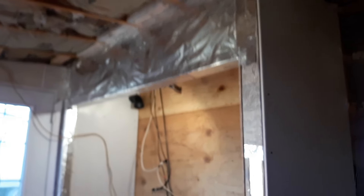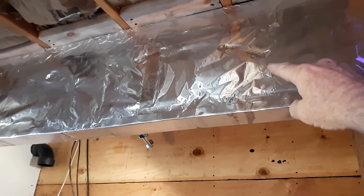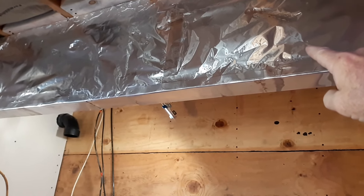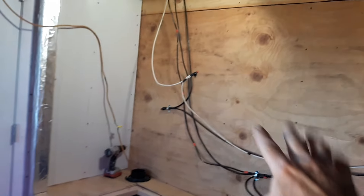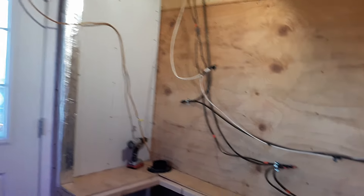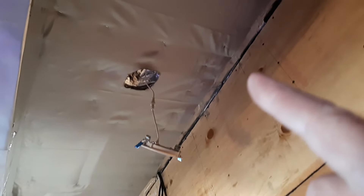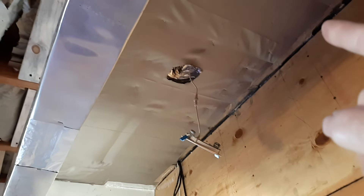This has been a lot of intense building and planning. I want to show you the top of this. We are putting at least four layers of aluminum foil and the cloth up here to block the EMP and the EMF signals. This is metal — we have some flashing here, and we're going to put a frame and a screen wire on the front so you'll be able to look through here but it will still keep in the signals. Here's our light — it's an LED light going up in the ceiling in that hole. We've got our silver nickel cloth and our aluminum foil, two layers of foil plus the cloth, and the drywall is going on that. Same thing on the back of the wall.